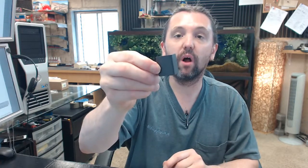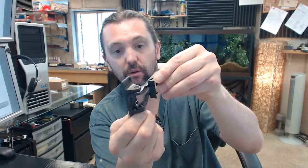The bump plate, or protective plate, is installed on the push side of the door. It is intended for when the door is open and this unit goes from the open position to the closed position — it is hanging into the opening — and if the door closes, the protective plate is what will make contact with the face of the hardware rather than the edge of the door.